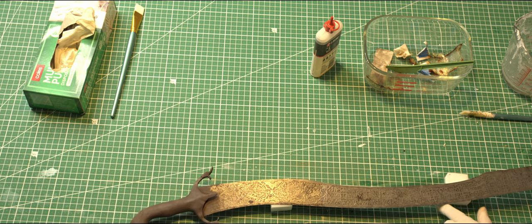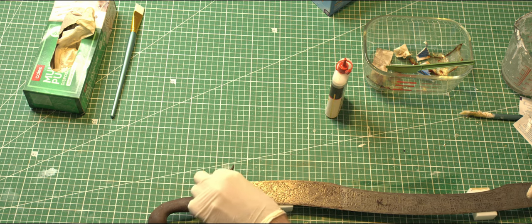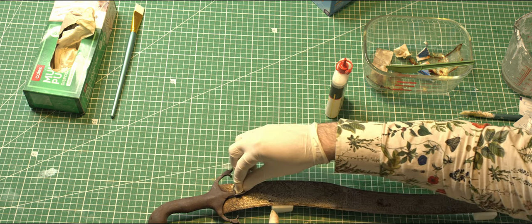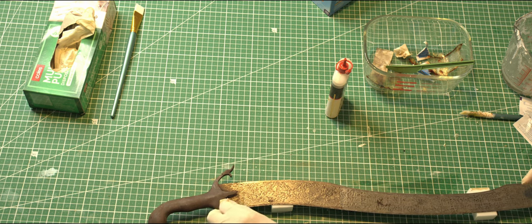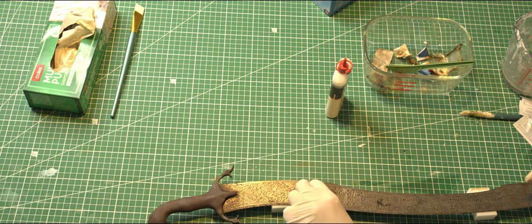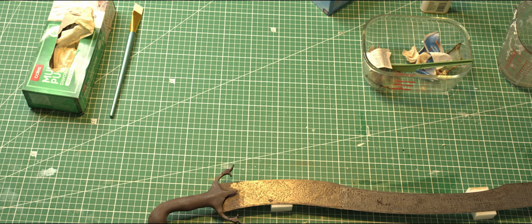One good way to visualize our progress as we work on restoring this object is to look at the spine, because we haven't intentionally applied any EDTA to it. If I wipe it off entirely, the entire spine is still a pretty even brown colour. When you compare it to the blade on this side, which has been completely restored from tip to hilt, you can see that we've vastly improved the condition of this object without over-cleaning it — we still have signs of age, we still have some stable black corrosion products, but we've revealed all of the details. We have one more portion of the blade to do, and then the real challenge begins when we move on to the hilt.